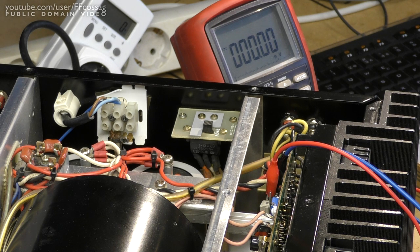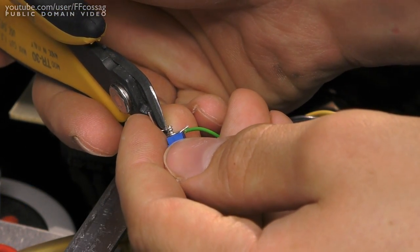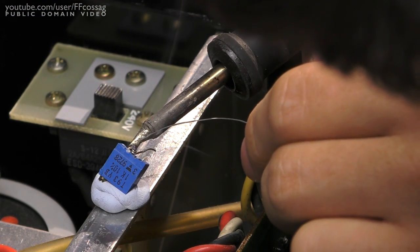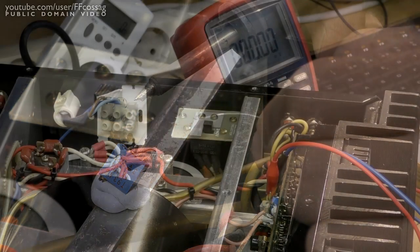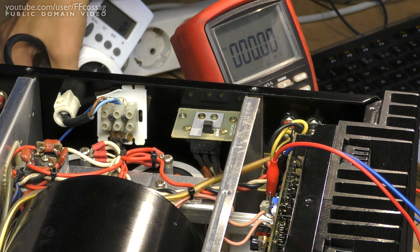After meticulously maintaining, cleaning, and finalizing that potentiometer, I went on to measure it in order to preset the bias to a reasonable level by adjusting the pot to about 400 ohms — and I realized I'd made it a 100 ohm pot instead of a 1K one. So I've now entirely replaced that. We're using a 1K 10-turn pot because that's the best thing I've got — at least we'll be able to very accurately set the bias now. With this pot I actually managed to trim it to about 400 ohms as intended, and we should have a reasonably sane bias. Let's give it a go — flick the switch and see what happens.